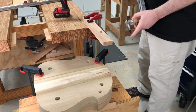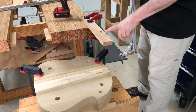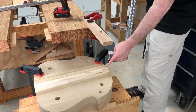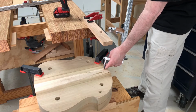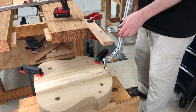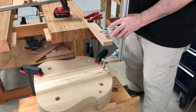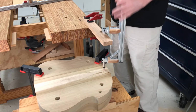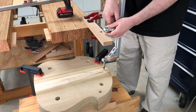All right, in this first demo, we're using the large spindle guide with the pointer feature, and we're going to be drilling it in this arm bow here. And this is a test board, and we're putting the pointer into the little pinprick that's on the seat blank, indicating where the mortise will be drilled after we drill the spindle mortise in the arm bow. And we're drilling a 5/8 inch spindle, and it's about 8 inches above the top of the seat blank.